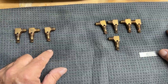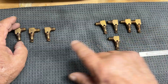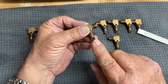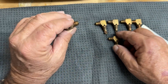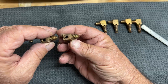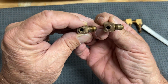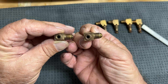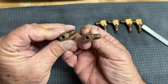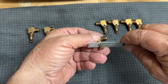So we've got them cleaned up a little bit. In my previous video where I talked about these kind of nozzles, I showed how some of them are canted — the deflectors are canted a little bit so that when you install them in the motor, two of them going like this and then two coming like that. We talked about how the ones at cylinder one and three would be kicked up a little bit so that the hose can be connected without interfering with number three. We verified that by putting a straight edge on the back of the deflector and looking at how they'd be installed in the motor.